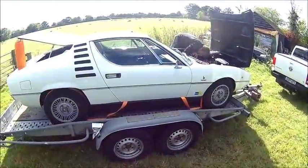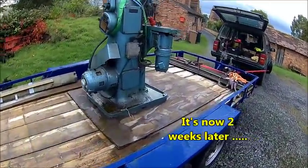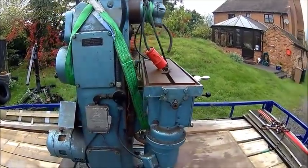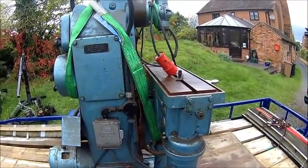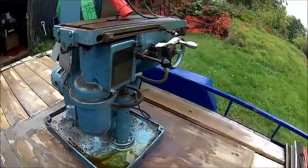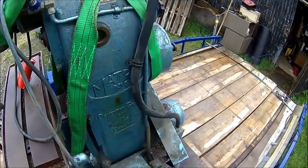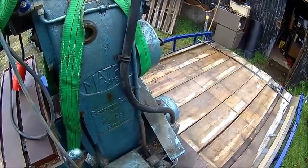Finishing that Montreal here. Today is the day we are going to move the mill. First, we are going to take the table off and the overarm on the vertical head. It's been sitting on the trailer for two weeks and is soaked in WD-40, so it should be alright. We'll probably take the table feed motor as well because we need to look into it anyway. Maybe the coolant tank too, just to make it more manageable.